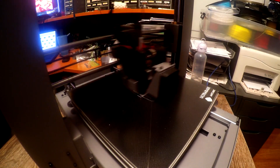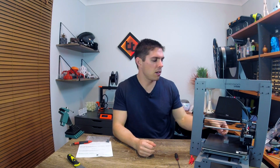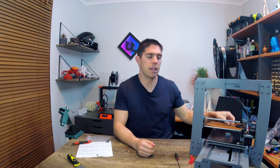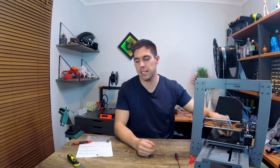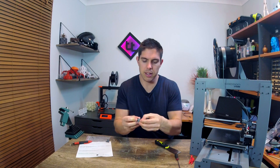Time to test with PLA. The first time around I chose ABS because it was hard — I chose a print that was meant to be a challenge — and it did that. This time I wanted to do an ordinary cube in PLA just to see if it works as advertised. It did stick and print first go, but here comes one of the downsides of this system: I have to wait for it to cool before I try to remove it, which for someone impatient like me is hard to do. Well, it's finally cool to touch, so let's try it out — it should just lift off without any particular effort. And once again it is stuck; I'm going to need to go for my scraper. It did come off — wasn't too bad, not as hard as a regular print.